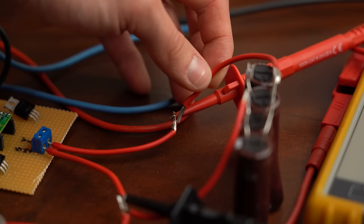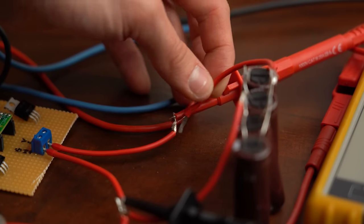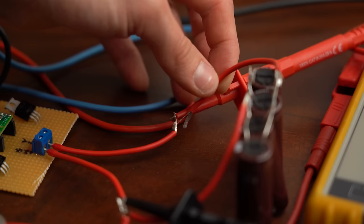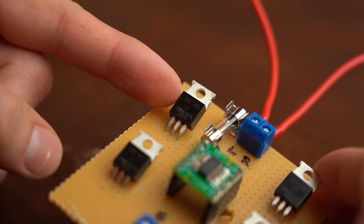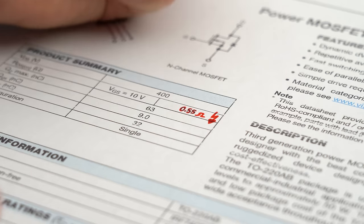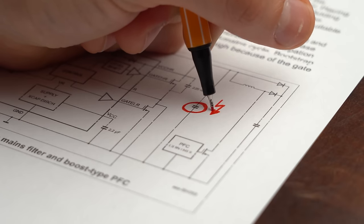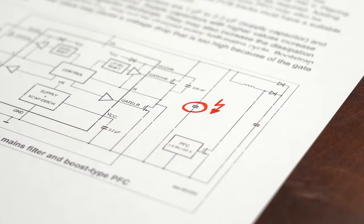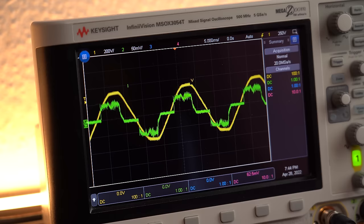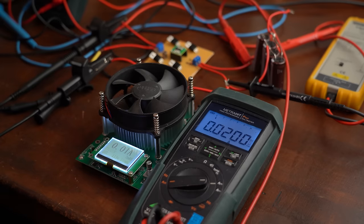While trying to charge up the capacitor bank for the power test there appeared to be some sort of short circuit problem with the rectifier. Not sure if my design with the low-cost high-resistance MOSFETs is the problem, or whether the topology and IC generally cannot handle capacitive loads — the datasheet also states that a boost-type power factor circuit must follow the application, which more or less prevents current surges from capacitors. The circuit does however work just fine with resistive loads.